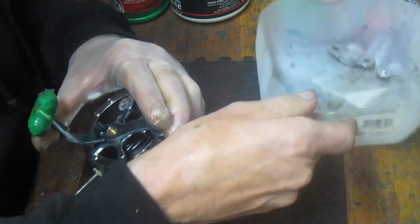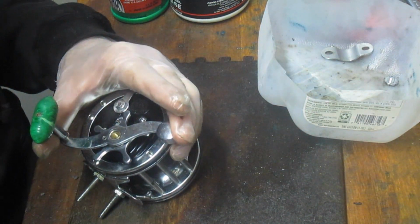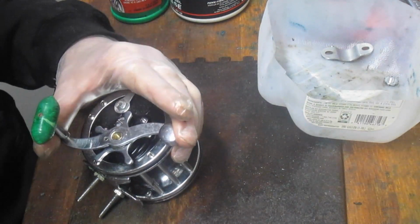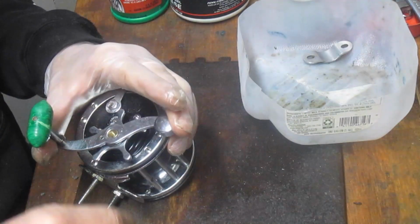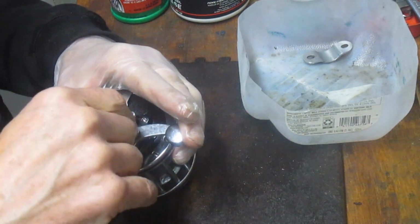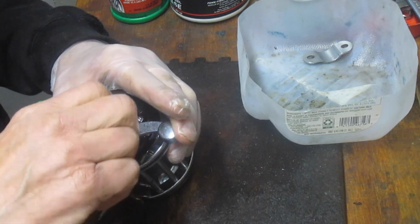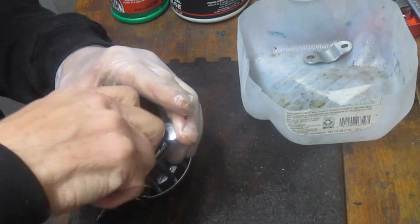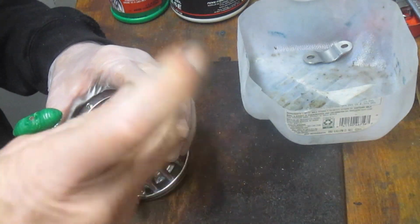Just looking for the nut I picked up off the floor. And quite honestly not seeing, oh, here it is. I put the screw. I keep calling it a nut. Now, if you didn't put the grease in there, you could put a drop of oil in there at this point if you were tuning up and you didn't take that gear sleeve off. Tighten this down now.